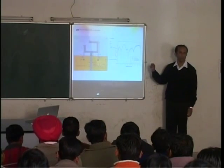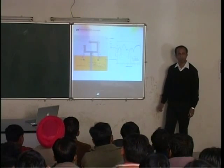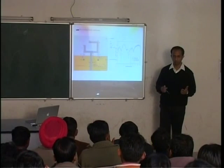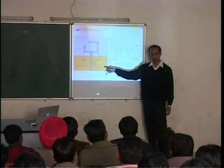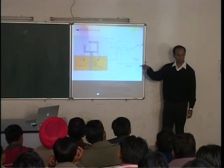So this is the idea. However, it doesn't work very well. The idea was that this antenna should be operable in either this frequency or that frequency or both. How do you turn both of them off? Zero bias. Both are off. Positive bias, one of them will be on. Negative bias, the other will be on.